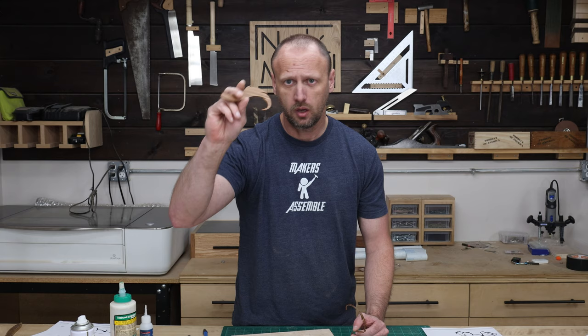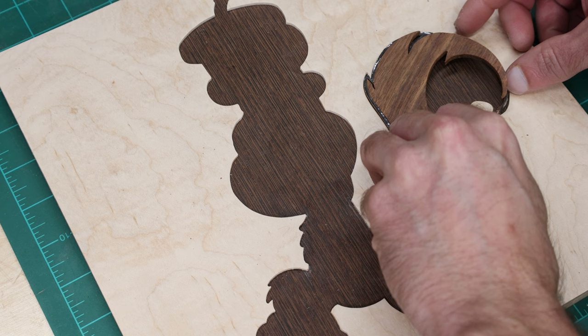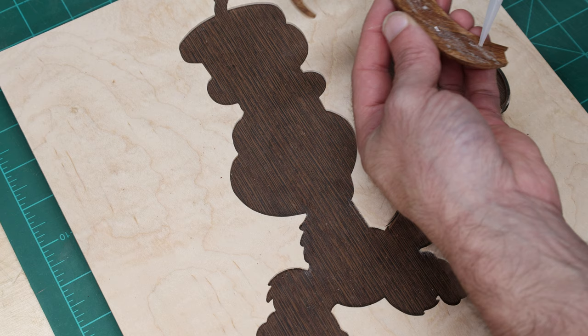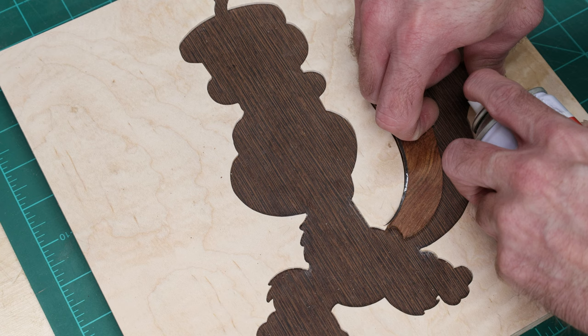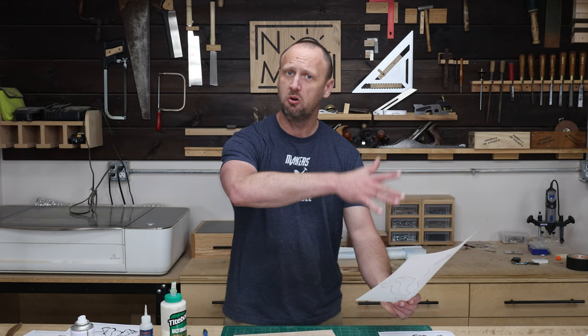I got the tail cut out and I also have that shadow line saved. I'll press it up against the maple, then set the tail in place and make sure everything fits right before I glue it. For a piece this big, I'm going to use a combination of wood glue and super glue — the wood glue gives a lot of strength, and then mixing in some CA glue makes it dry really quick and holds it in place so I don't have to clamp anything. I have to be careful not to have any squeeze out because I'm going to put a lighter piece close to it and don't want glue interfering with that lighter piece.